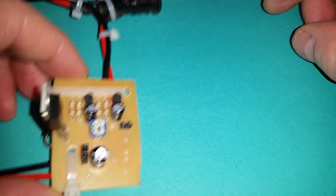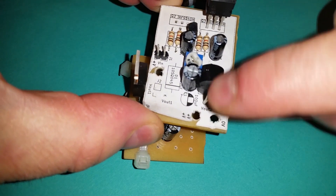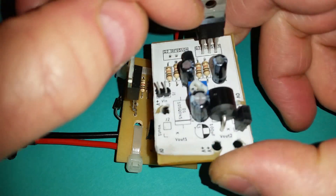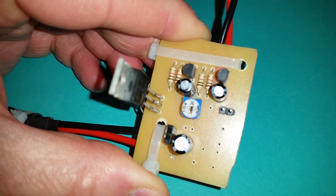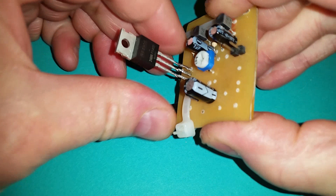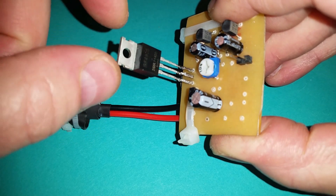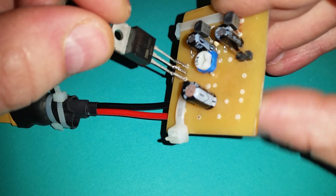Finally I've got this circuit. On the previous circuits the top part is configured to drive power from one of the transistors on the flip-flop. I've still got a BC327 here, but on this circuit I'm driving a MOSFET, which can drive up to around 70-74 amps and 54 volts, so this should be able to drive a much bigger motor.